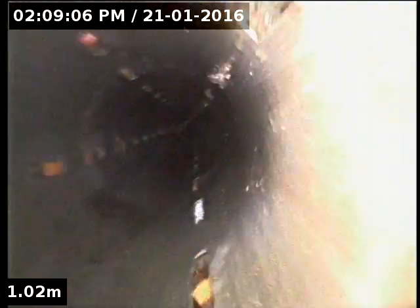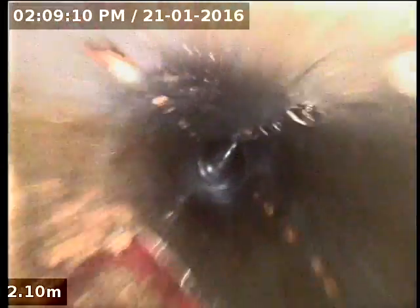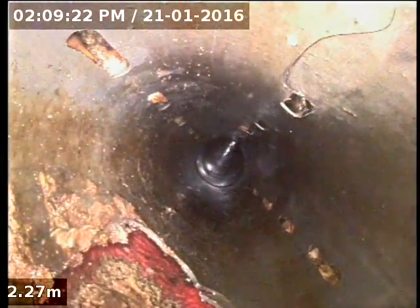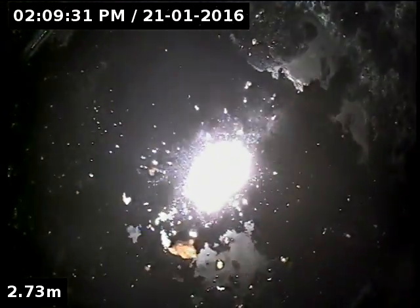Going back upstream — it's still actually slotted pipe all the way under the pavers here. There's a bit of cracking; it might have a patch over it, it might not. That's the grease trap there — you can see it then drops down and goes into the bottom of the grease trap, so that's all clear.